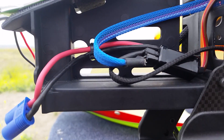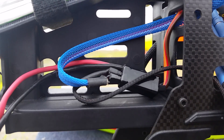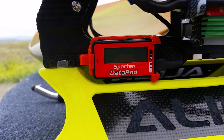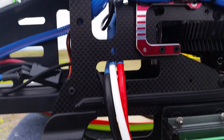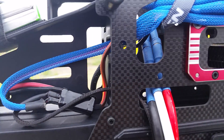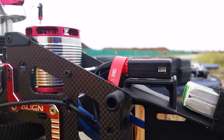By doing it this way, I take away all the loop noise and all that frequency noise that could interfere with the transmission from my radio to the receiver. This is a true Spartan heli data pod on board with a holder, vortex nano, and Spartan data bus micro — there it is. I feel really secure about having the two power sources coming in.